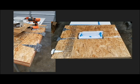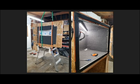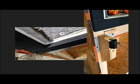There was a lot of measuring and making sure I was mounting the hinges in exactly the right spot. Most people would put them on the cabinet and then hang the door, but I went with the reverse because the door is so heavy. I took my six foot ladder and clamped a 2x4 board across it at exactly the right height for the door. I tipped the door up and strapped it to the ladder, which let me precisely orient the door so it was exactly plumb and at the right height. When I first swung the door shut, it swung so easy you could push it with the nail on your pinky finger and it would silently open or close.